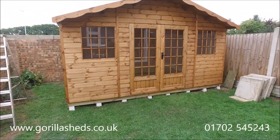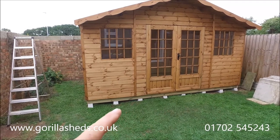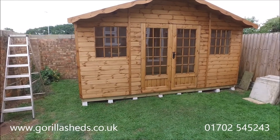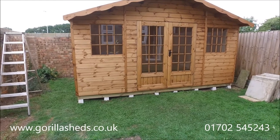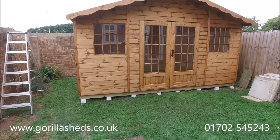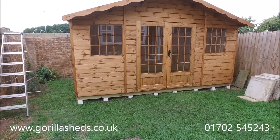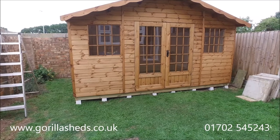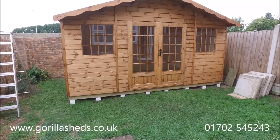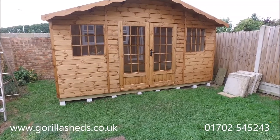If you look at the front of the shed, you can see all these along the front here — they're concrete fence posts. What we've done is laid down some concrete fence posts, leveled them up just under two foot apart, and then put down a 4 inch by 2 inch pressure treated frame covering the whole of the shed. You can lay shingle under there — basically that shed will never ever sit in a puddle.